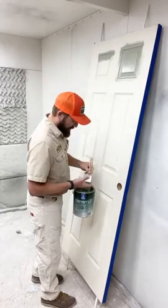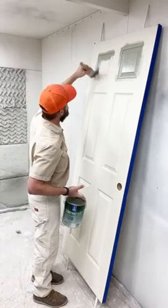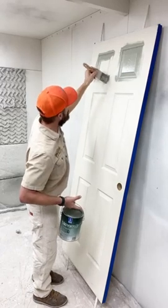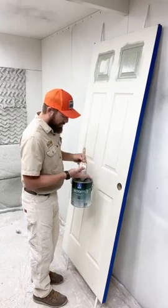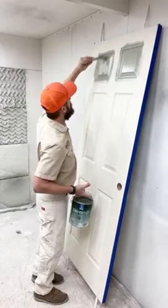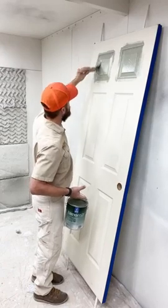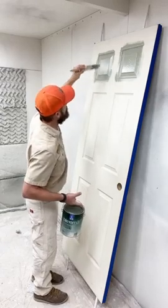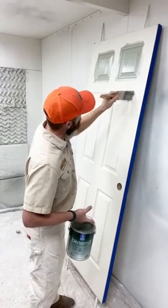So Emerald Trim Urethane, years ago when it came out, it was a great, and still is, a great alternative to oil and water. So typically what they tried to do with Emerald Trim Urethane was find a great paint, a coating, that will give you the advantages of an oil enamel, you know, the toughness, the beauty, the sophistication, but not the crazy dry time and not the smell. And I think they did really, really well. So this is a water cleanup paint.